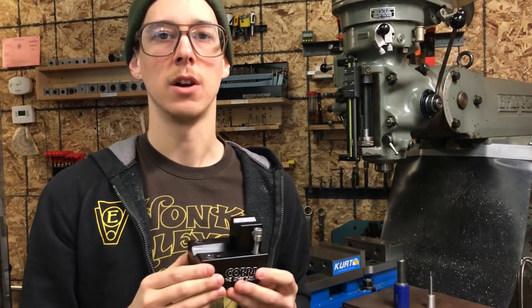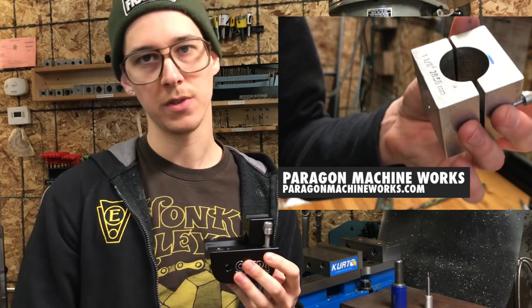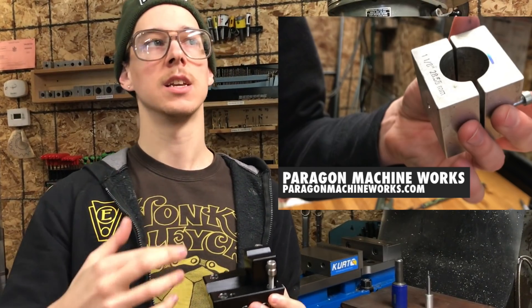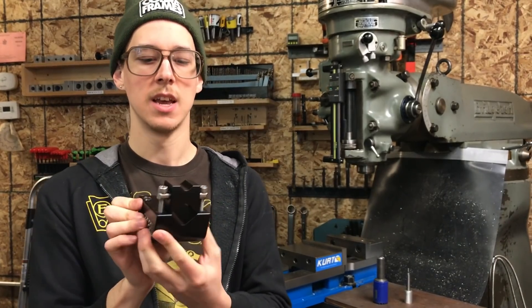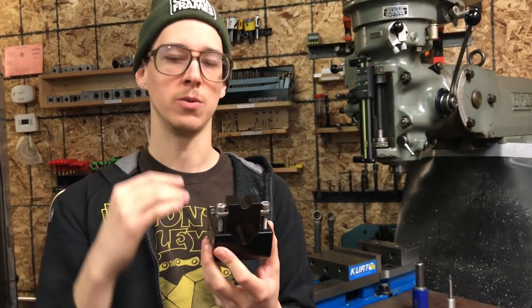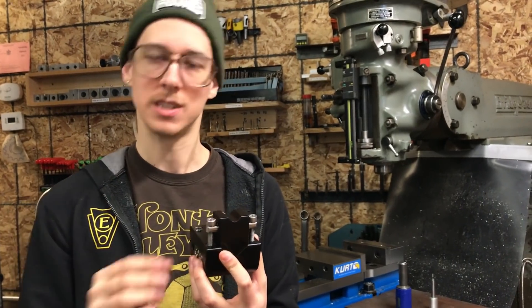Another really cool feature is it holds all different sizes. You can get Paragon Machine Works tubing blocks in various fractional inch sizes — they make one for 27.2 millimeters, a common seat post size — but occasionally in bike fabrication you'll run into oddly sized tubes on the outside diameter that don't fit into common tubing blocks. Something like this that can fit that whole range from the smallest to the largest doesn't care if you're on a fractional inch size or not. It'll just clamp the same as long as you're within the size range.